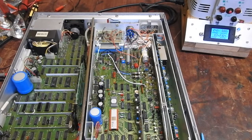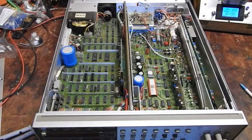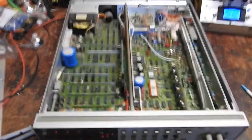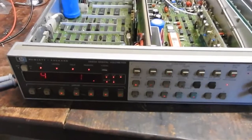The fuse checked out okay, and the rear voltage switch is set to 240. I'm going to start it off with a low voltage of 26 volts and plug this in to see what happens. Nothing happening. Winding up the volts, looking for smoke — not seeing any. The fan has just come on, so there's obviously some DC power. Now where is that smoke coming from? Only sticking a hundred volts in at the moment. I'm getting some carry-on on the front panel.